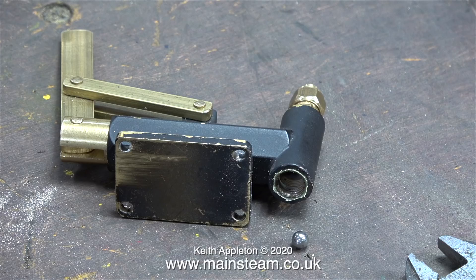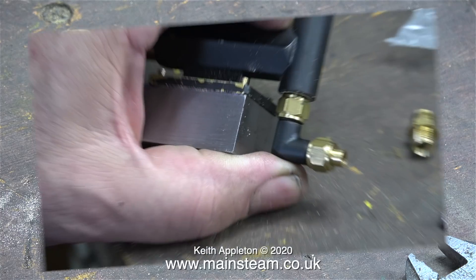As you move the lever and pull the ram out of the cylinder, the bottom ball lifts and water is sucked into the cylinder. Then when you move the lever the other way, the bottom ball seals with the pressure, the top ball lifts, and water is forced out of the top of the pump.